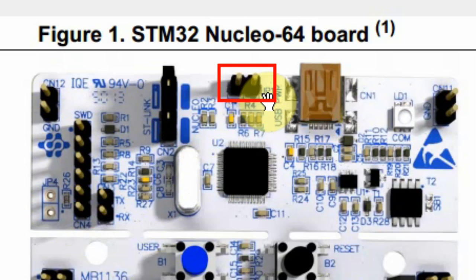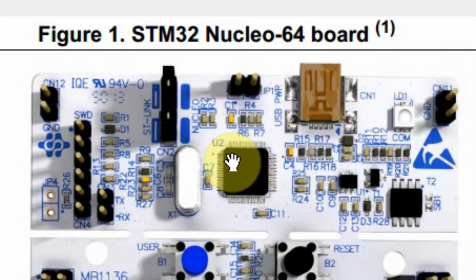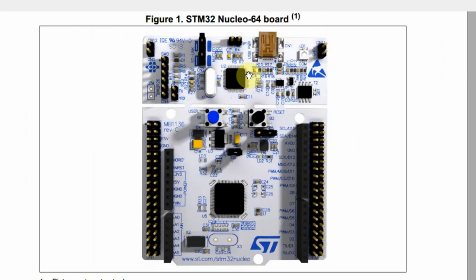The JP1 pin is an override pin. The STM32F103 ST-Link holds the N-Reset pin of the main microcontroller low as long as you are not connected to a computer. If you want to power your board, you have to connect one jumper to the JP1 pin and then you only need to power the board — it overrides the N-Reset pin. You can find two jumpers behind CN11 and CN12.